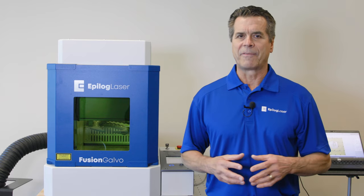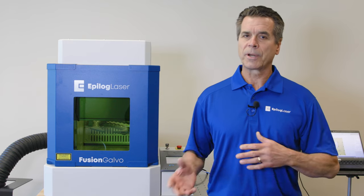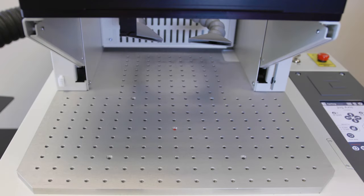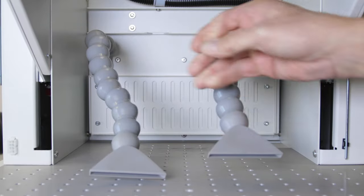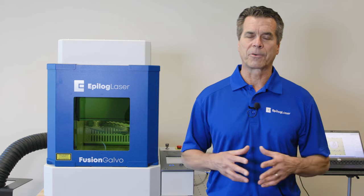Like all laser systems we manufacture, the G100 has a 7-inch touchscreen display, an onboard camera system, integrated exhaust control, USB network and Wi-Fi connectivity. Also included with the Galvo-based machine are both the F-Theta 163 and 254 lenses that give us a 4x4 and a 6x6 marking area. We have an oversized table to accommodate larger parts inside the machine, a large viewing window with motor-driven non-pneumatic automatic door, and two-point movable exhaust inside the machine for great evacuation of particulates.